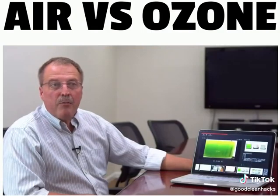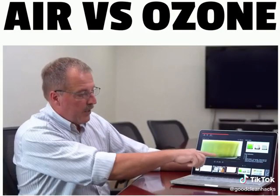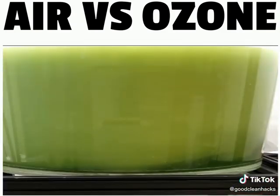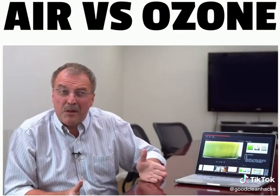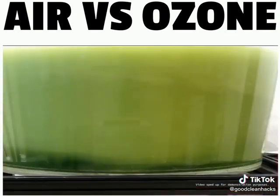We're going to start it up with just air. Nanobubbles are invisible to the eye, but we're generating trillions of them, so they diffract light, and that comes up as this white that you see. If you focus down here in the bottom, you're going to see this is just air coming in, and it's not changing color — there's not a lot of differences here. So what that means is that although air may be doing something, it's not doing very much, not in a timely fashion.